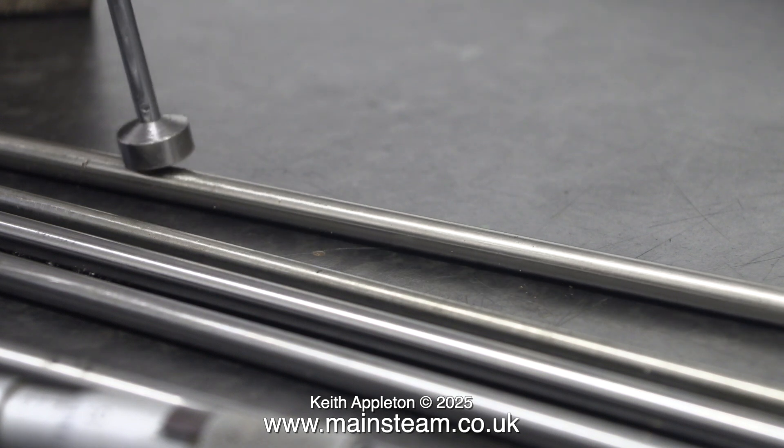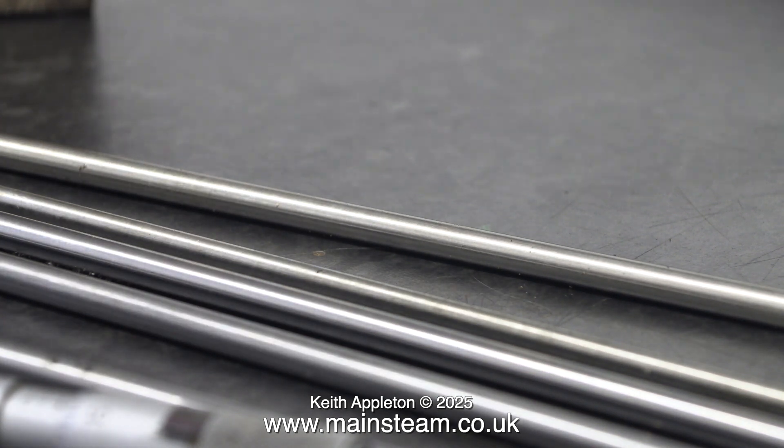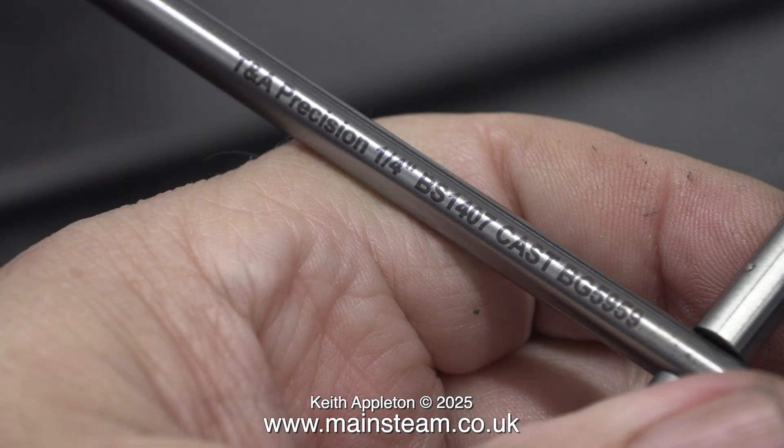Here's what's left of the non-magnetic stainless steel once I cut it to make the crankshaft. You may find this interesting — silver steel is accurately ground and the micrometer tells me that it is exactly a quarter of an inch in diameter. No pluses or minuses, exactly a quarter of an inch.